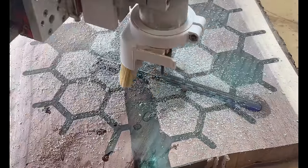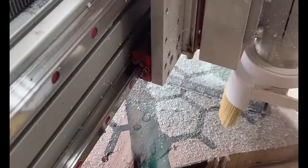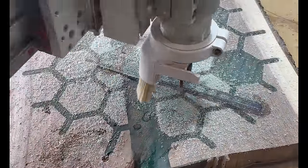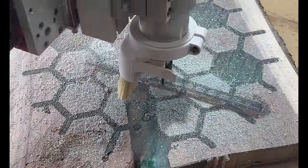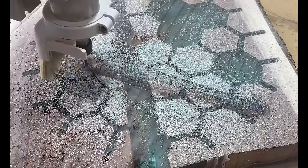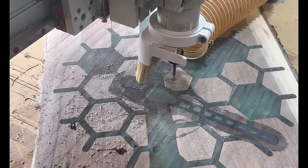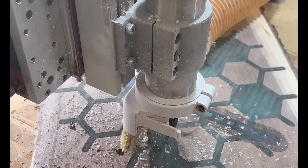Again, here I use that little trick to flatten it out using that quarter inch bit. It's fun to run the CNC by hand when doing these things because you feel like you have ultimate power over it. I'm sure in the future it'll get old and I'll write the G-code. The G-code is just the code that's used to run the CNC, as opposed to running it like I'm doing here, hitting the arrow buttons. And as you can see there, I made one cut that was a little deep because I accidentally hit the down button.